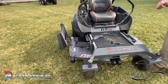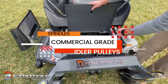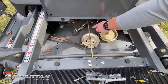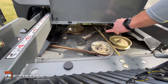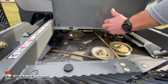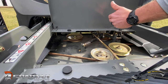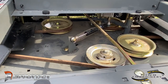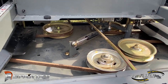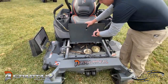You're also going to get commercial grade spindles and idler pulleys on every deck. Underneath here, you also have the dampener system on all of the deck systems. That helps take out your chatter — whenever you start up your PTO, there's always some slack in your belt that chatters around. This dampener system combined with the spring is going to take a lot of that out and help extend the life of your deck belt.